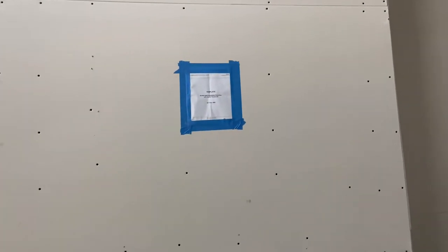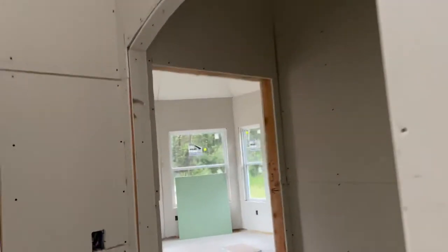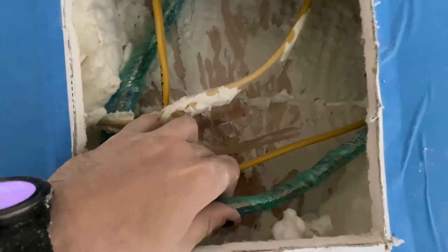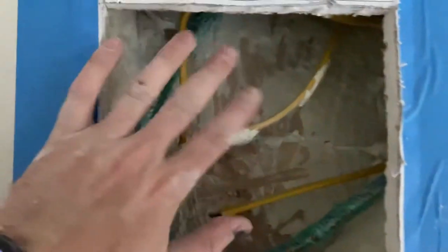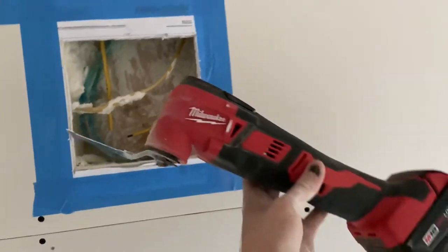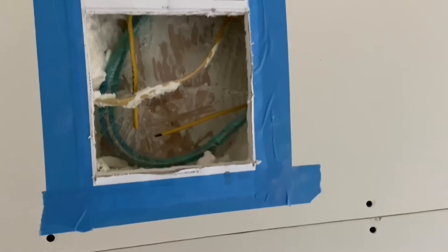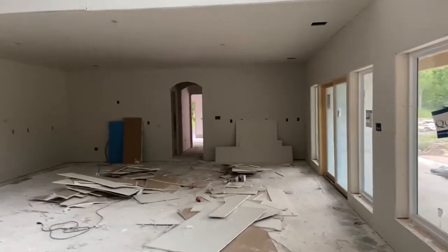This is what it looks like before. Once you have it positioned and you like it, you just — back to grade school — cut on the dotted line. Here is the completed work. As you can see, here are our wires: we've got our power wires and our ethernet right where we planned it. It's nice when a plan comes together. You just pull the template off the wall and the recess box slides into the cavity. It's got little ears that you screw down to pinch between the drywall. What I used for that is a multi-tool — I use the Milwaukee one since I'm bought into the Milwaukee system. I got the cheaper non-fuel version, because for most of my use cases like cutting drywall and baseboard, I really don't need to pay extra for the fuel version.